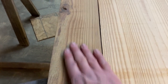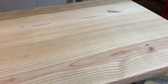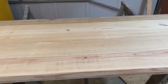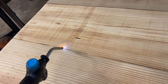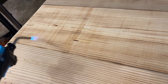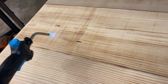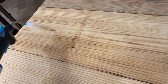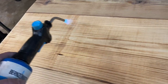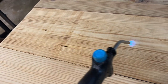Notice that the one back here is actually a piece of treated wood, so it's going to look a little different - but that's alright. I'm just happy we were able to find enough scrap around here to do this without spending a dime. Now I'm going to show you a little bit of this burning technique - just keep the flame moving and you can see it will actually darken the grain and kind of highlight it. It gives it a little bit more character. See how it's darkening it up and when you put linseed oil on there it really pops.